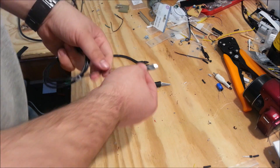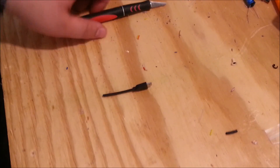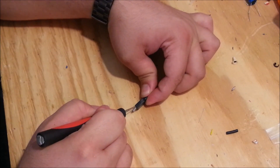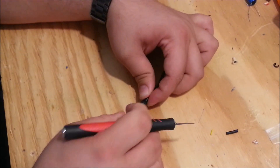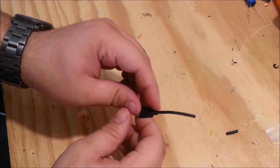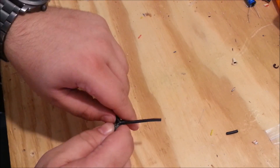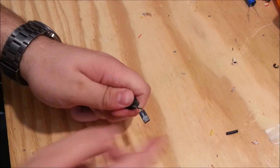The first thing you want to do is just chop off the end of your micro USB cable. Leave a little bit of wire so that way you can identify the polarity later. Next, take a very sharp razor knife or X-Acto blade and cut along the edge of the micro USB end. There's usually a seam to help guide you — this way you can free the metal housing. After doing so, you'll be able to lift up the rubber enclosure and expose the metal housing, then simply snip it off. Leave a little bit of wire to help identify polarity later.